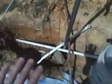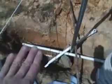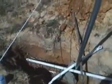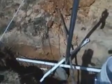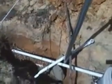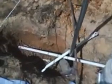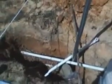So what we'll do, actually, we'll put some more gravel down in there, and we'll cover that over with roofing felt, 30-pound roofing felt, which I've got some extra stuff, and that'll keep the dirt up on top of the gravel, the drain bed there, when we fill the hole back in. It will keep it from getting clogged up and that sort of thing. So stay tuned.